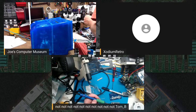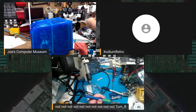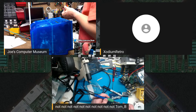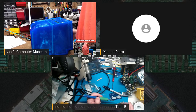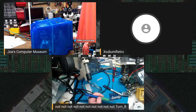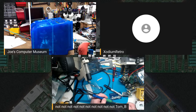And Drake's like, well, Steve knows what he's doing, so it might actually be an issue with the board. So Drake checks one in his Color Classic. I guess because it's a 512K VRAM SIM, but the Color Classic will only support a 256K VRAM SIM. It will just show weird lines on the bottom half of the screen. And to confirm it, I tried a stock Apple 512K VRAM SIM from my LC in my Color Classic, and yep, sure enough, it did the same thing.